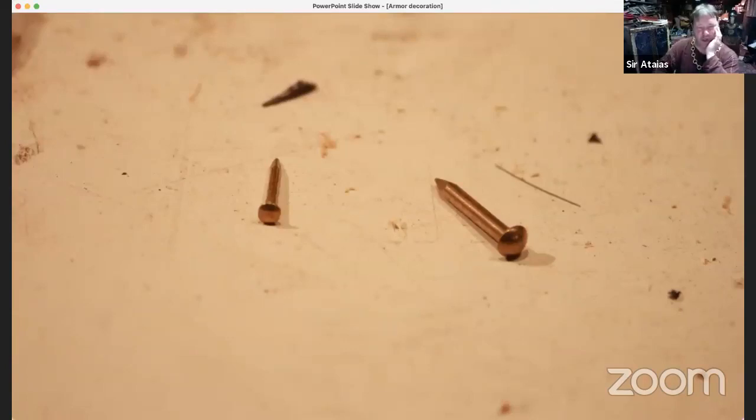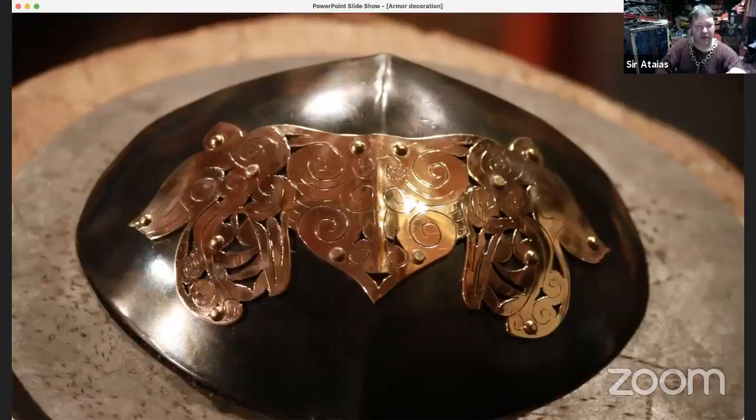My experience with these rivets is that if you want to keep that dome shape, whatever you're using as your backing to pin that over should have that shape or accommodate that shape. Otherwise it's going to flatten out the dome on a portion of it, especially if you anneal those rivets so that you can peen them over better. You'll notice the difference between some of these rivets. This guy and this guy are not annealed, and they have a bit of the top surface flattened out. Whereas these guys right here are ones that I annealed, and they really just got squashed.